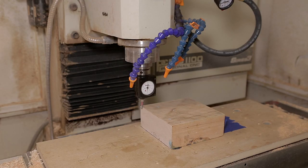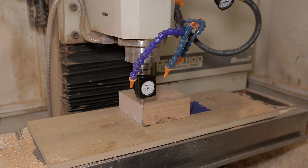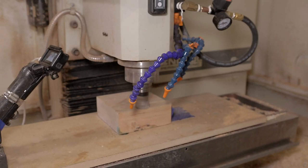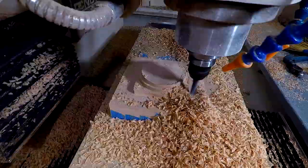I then indicate in the piece again. Like before, the orientation of the piece doesn't need super high precision for this step — we don't need great precision until we flip it over and do the other side of the bowl. Then the machining process starts: the facing operation happens first, then the 3/8-inch bit to rough out most of the material, then we jump to the quarter-inch ball-nose mill for the finishing passes.